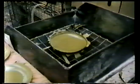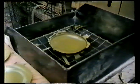2 or 3% more polymer than is really necessary is added to the mold to ensure that it'll be completely filled. The excess polymer is forced out as flash. While the next molding is being cured, the operator can clean the flash off earlier moldings.